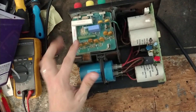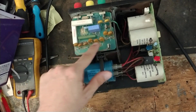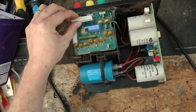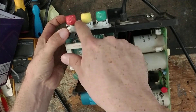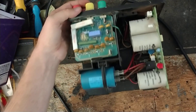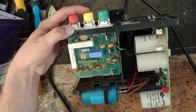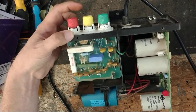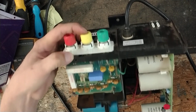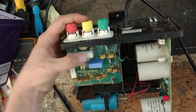This board here — all these little orange things and other components — is part of the lightning protection for the unit on the fence and ground side. It also divides the voltage out for your half power and full power through this resistor here. Most people don't use this half power. Occasionally this resistor will go bad and you lose your half power, but you still have your full power. About 90% of the people that bought these didn't even use the half power, and the voltage is about the same between full and half — it's just the joules are a lot less because there's a resistor limiting how much is coming out.